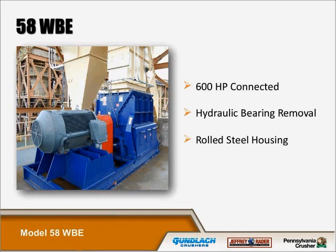Screening will ensure that no oversized pieces enter the wood hog, which would affect throughput rates and horsepower usage. Screening of the material will also reduce wear rates of the internal workings of the hog, and the generation of fines will be kept to a minimum.